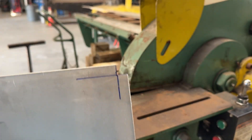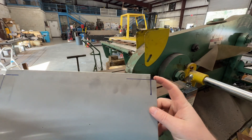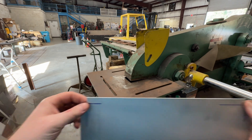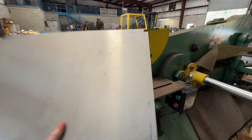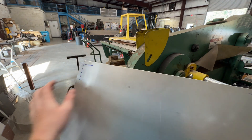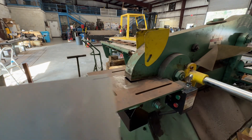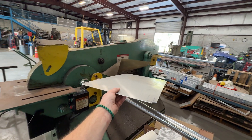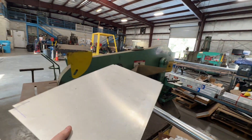Just like that, you've got some corners knocked out. What I'll do is take a file or a little flap disc and just clean up those little bits so I don't have any burrs on there. Then we can start breaking it — I think those marks are fine; it's not long enough where I need a middle mark. This machine definitely comes in handy — it's a really good shear; we switched the blades around on that and got it really good.